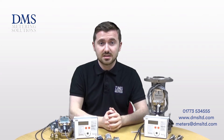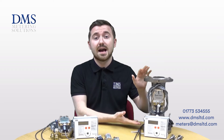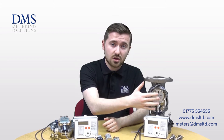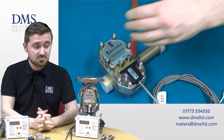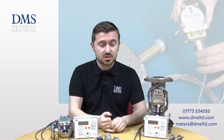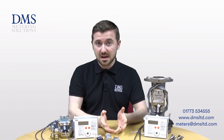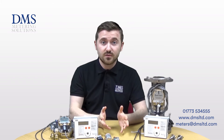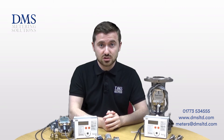There is a handy benefit with the 440 range. As part of MID guidelines the meters would need to be recalibrated every 10 years. For most manufacturers this would require the meter being taken out of the installation and sent back to the factory. But with the Sontex meters the sensor heads on the top here can be removed and even replaced, providing quick recalibration on site same day — removing the need to send the meter overseas, removing lengthy carriage costs, and ultimately making a much smoother installation. This also helps with any maintenance or required cleaning of the meter, though these are virtually maintenance free. The measuring principle allows for a very hygienic system and will be self-cleaning.